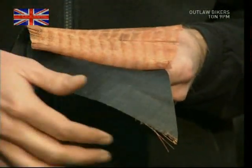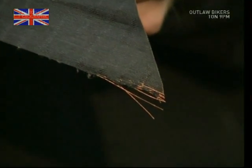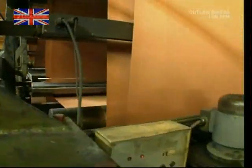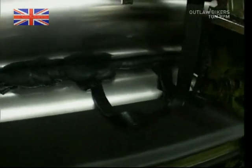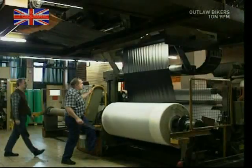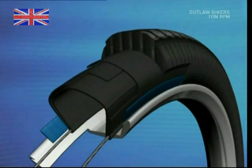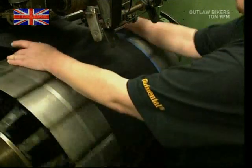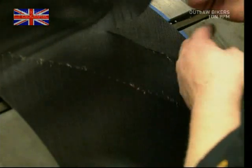So, you've got your rubber, but there's far more to tires than that. To create the carcass, nylon matting is added to make it stronger. Enormous rolls of nylon are threaded up onto these machines to be combined with the rubber mixture. It needs to be spread out like pastry, so the workers feed it back onto the rollers. This will create a big sheet of rubber, and the nylon can then be added in. When you're building a tire, you always start with the carcass — this foundation is expertly wound around a tire-sized barrel and glued into place.